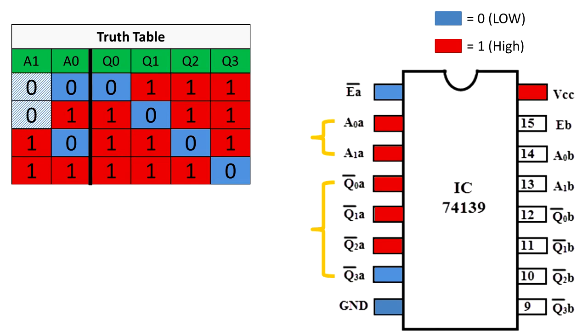Something interesting is happening here. When A1 is low, the output Q0 actually mirrors the input on A0. So whatever's on A0 comes out on Q0 — toggling A0 while keeping A1 low will toggle Q0 in exactly the same way. That could be our clock — we want our I2C clock to go in on A0 and come out on Q0, as long as we're pulling A1 low.